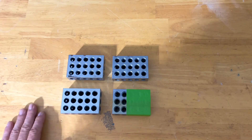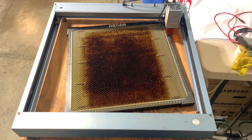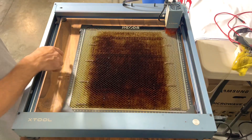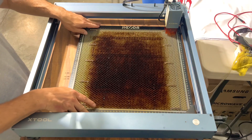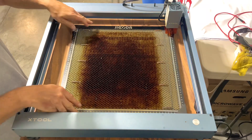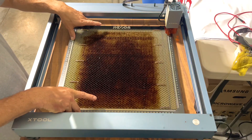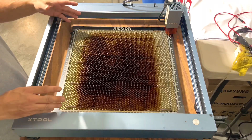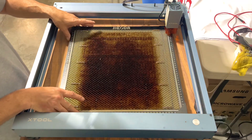So how do we do this? Let's take a look. As we can see here, this is definitely not squared up by any means. Even though I have the wasteboard down here with some grid lines on it, they're really kind of faint. And even if they were really dark, trying to take the edge of the laser cutting grid and line it up with that edge while moving it around would just be kind of a pain and it's really not going to be that accurate. A real easy way to do it is by using the one-two-three blocks.